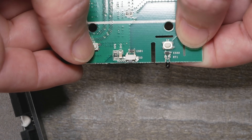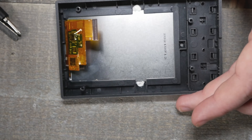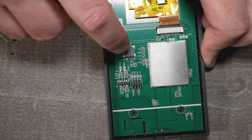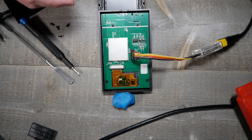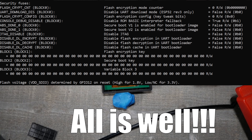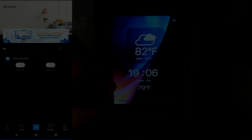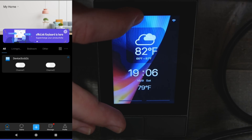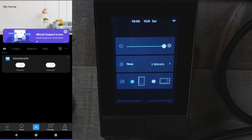There are the two front buttons — they add a little clickiness to it — and then of course you've got the screen and the case. I'm interested to see if the eFuses are blown, which would prevent us from flashing firmware. If they aren't, that's perfect. Once it boots up, on the US model I found it was set to landscape, so I had to switch it to portrait mode, since most of our switch boxes are in portrait orientation.